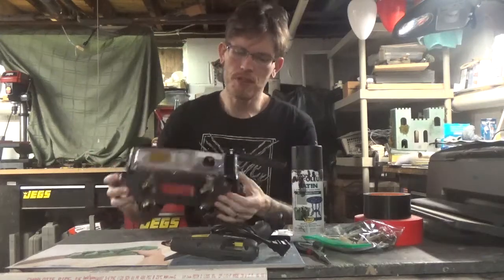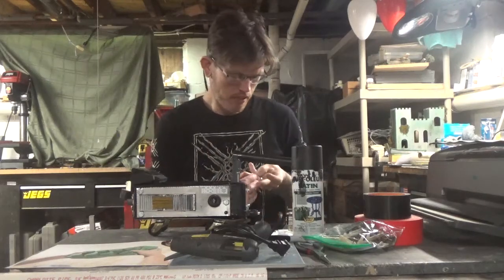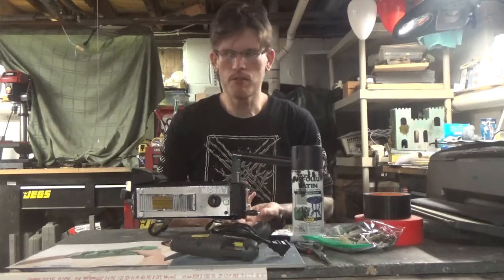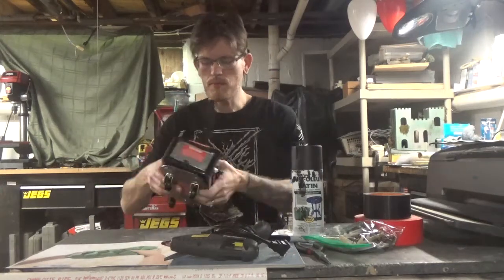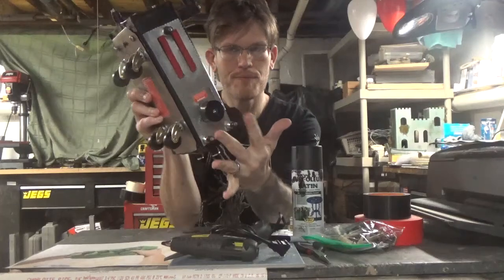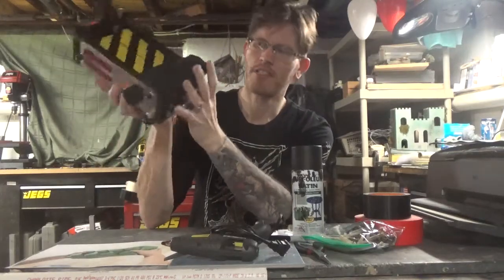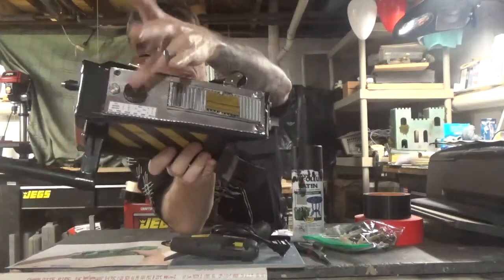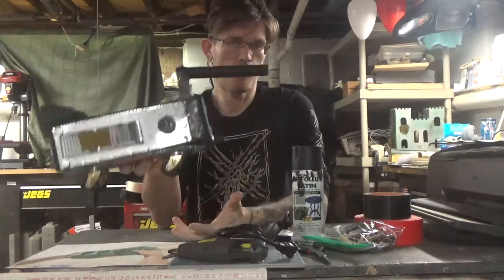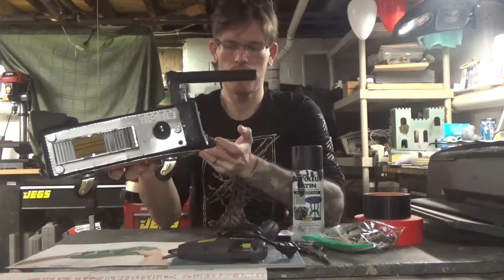And originally, I hot glued them on. That was another mistake I made. Don't use hot glue, because once it gets banged around, hot glue is not the strongest adhesive. Really, any adhesive you use is not going to last. Even if you use E6000, Gorilla Glue, anything like that. So what I ended up doing at first, after I saw that failed, is I put some really long screws in here, like that. Now, you don't need too many. And I screwed them in, and I put some bolts in actually, they're not screws. Put some bolts in, as you can see, and then screw them into the other side. And now that's never going to separate, never, unless I really get a wrench and want them to come off. Okay, so I had my metal in on the side now.